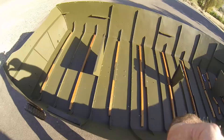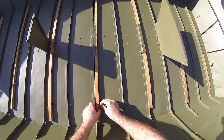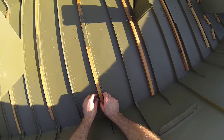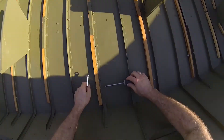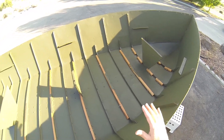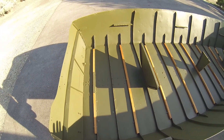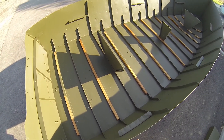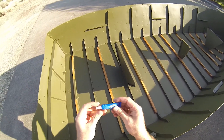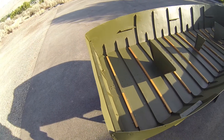I went through and made sure all of the struts were lined back up and the bolts were in and everything was tightened down completely. The oak cross slats for the reinforcement for the floor are screwed into place and they've been soaked in two coats of Thompson water seal, so the oak should be stable, nice and strong, and it's not going to warp. The screws are in place holding it to the frame. Now we're going to put some thread lock on all those nuts so as we're bouncing around in the waves they can't come out.